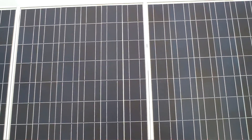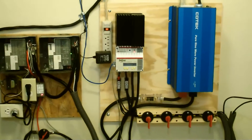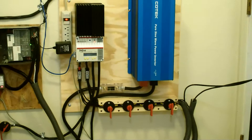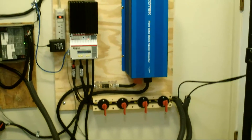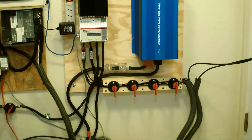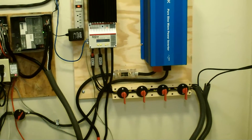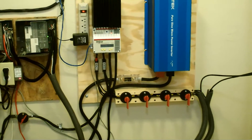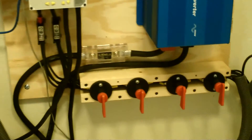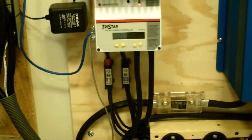I'm going to head over now to the controller battery room. Here we are in the battery controller room — I'm going to go over some of the equipment that's in here. If you look over in the lower right-hand corner, there are a couple of pneumatic lines heading out to the array set, and inside those sleeved plastic is the four sets of number 10 stranded wire with the 72-volt circuits on each one of them. And then I have battery cut-off switches I'm using to isolate each one of the four circuits.